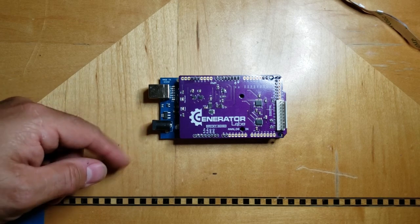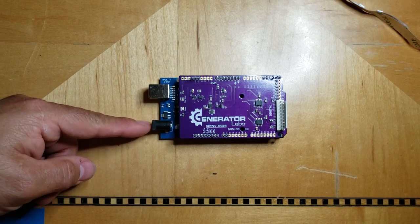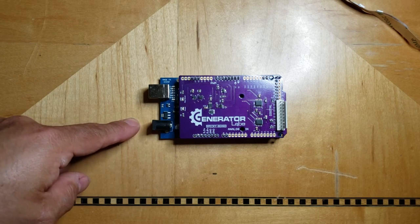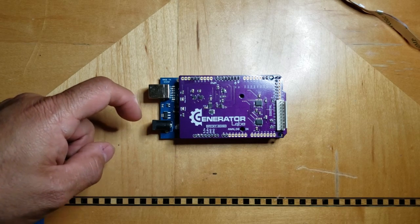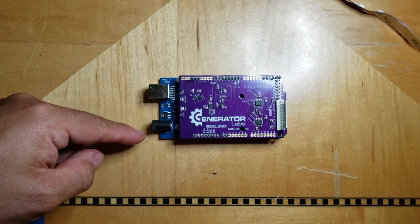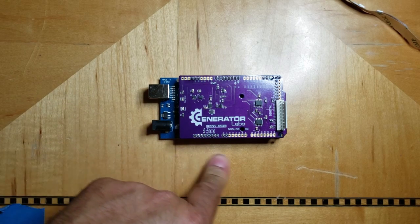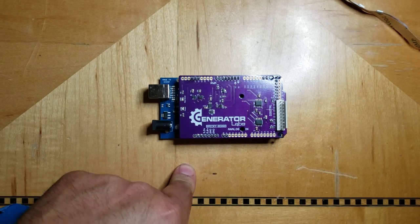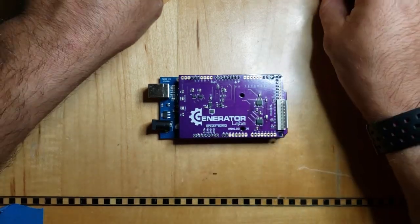So that means you can have 5 volts coming into this barrel connector, and you're not sure that it's really regulated, and so that unregulated voltage gets into your Arduino circuitry and now causes the Arduino to act erratic. I'll give you a pretty good scenario of what could happen here.